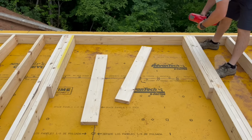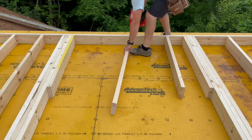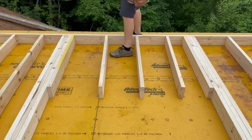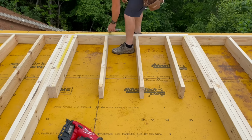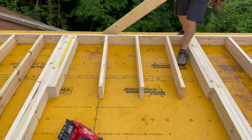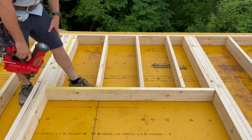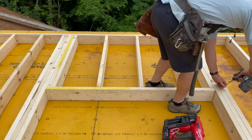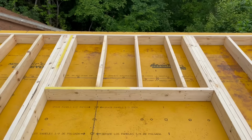It happens a lot of times in this area where you're standing on a subfloor platform looking around and you realize that the windows on the drawing aren't facing exactly where the view is. And in this area, that's why people build houses here. They want to see the view. So it's very common that I move the locations of windows around to accommodate and maximize the view that they get to see from any room. I want to say that this type of on-the-fly change would not fly on a lot of different types of jobs, but on these small one-off houses, I've never had a problem.